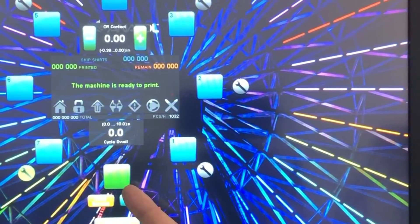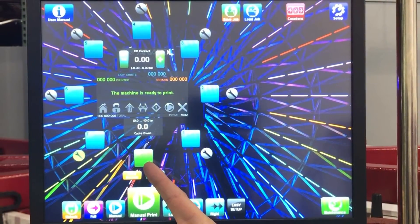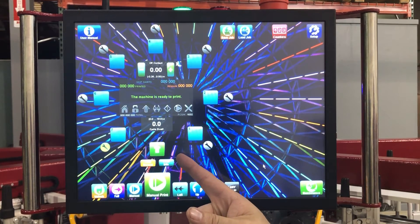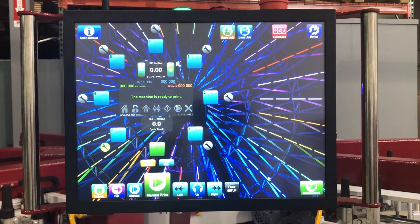Located here is a green pallet, which represents our load station. This pallet has many options — some of you may remember them as print start or print finish, but we have adapted new print icons for these features. This icon represents print start, telling the machine that I am loading t-shirts and will continually put shirts on after this as well. This is the print finish icon — I use this to indicate this is my last t-shirt, or my only t-shirt for test printing. While the machine is stopped, I have a third option of a blank pallet, which I can use if I make a mistake and need to tell it I missed my shirt. Ideally, we want to get in the habit of being in full auto mode and flowing comfortably from print start to print finish.